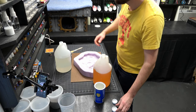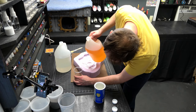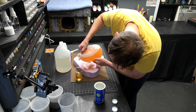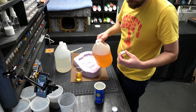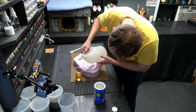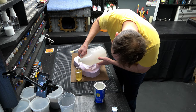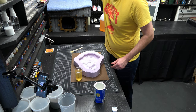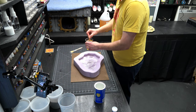This is the urethane resin I'm going to be using — it's a two-part, one-to-one ratio urethane called Easy Flow 60. It sets up in about two and a half minutes so you have a pretty quick working time. I got that from Brick in the Yard. They've got a YouTube channel which is actually really helpful — I got out of casting for a few years and I've been watching their videos as a refresher course. I learned quite a lot. There was plenty I already knew, but also quite a few new skills I've picked up just by watching their channel.